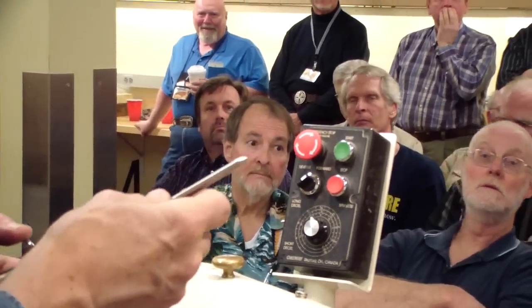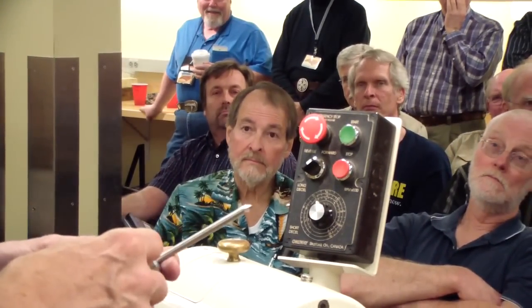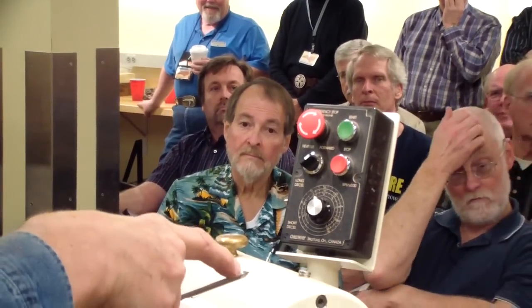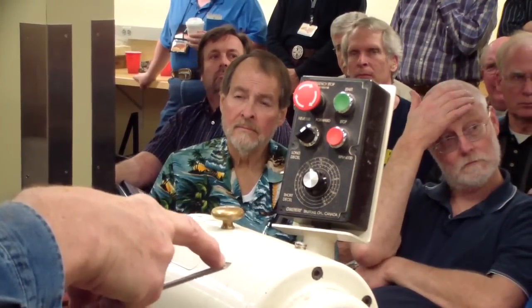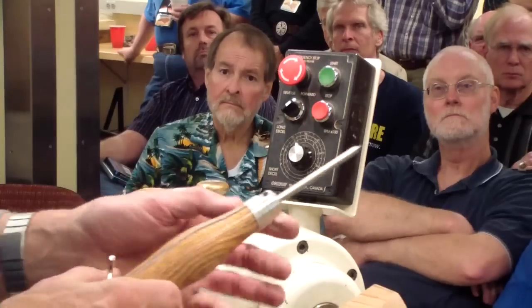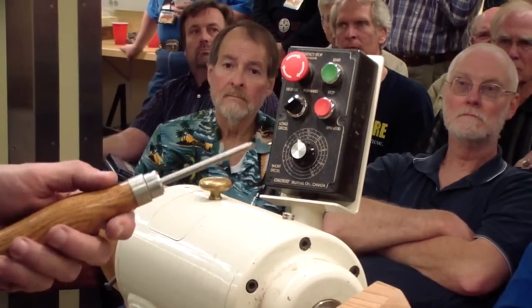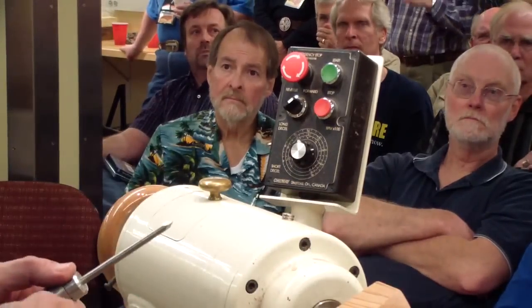Grind both ends, just turn the other one over. And then when you put it in there, put the top side during use in line with your set screw, and now you know where it's at when it's up inside of there, or when it's left all over. You look at your set screw, that's where your cutting edge is.